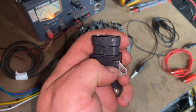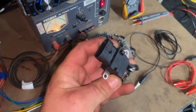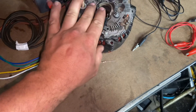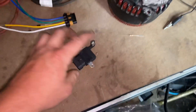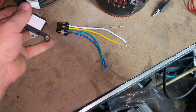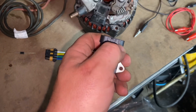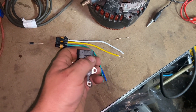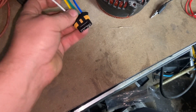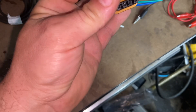This is a regular four-pin GM alternator terminal. For the four pins, we'll only be using the yellow wire which is on the L terminal — that's for your lamp — and the blue wire on the S terminal — that's the sense wire. Those are the only ones you're going to need to use.